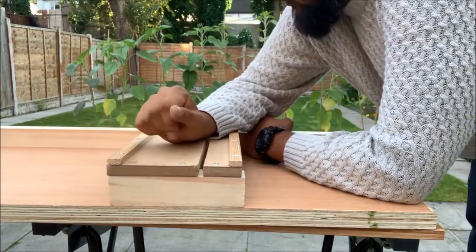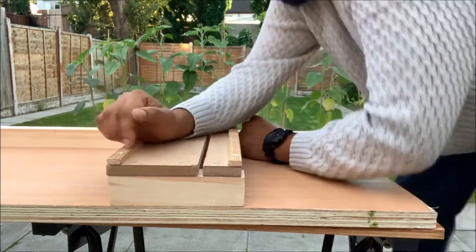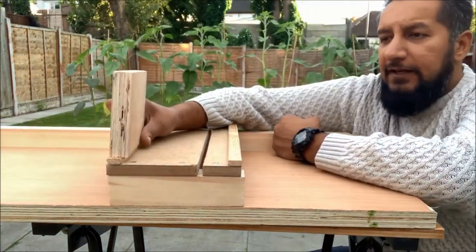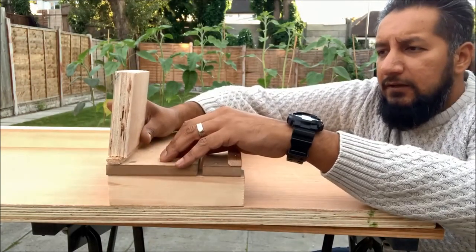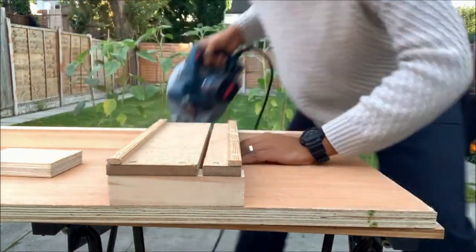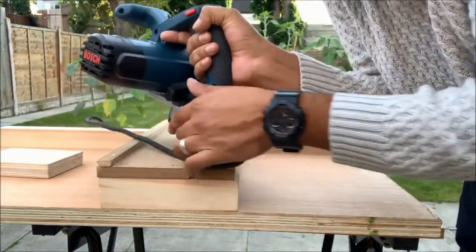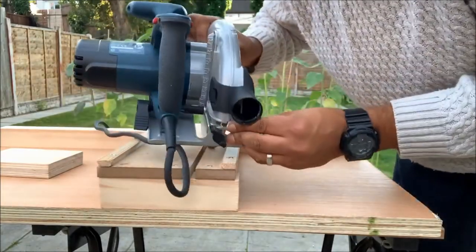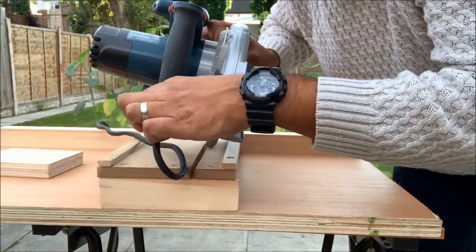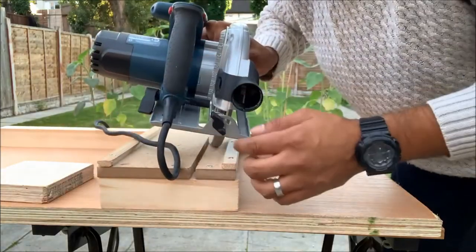As I mentioned, I did want to use the same plywood for this section, but a couple of things happened. That's the wood I would have used — cut to length, maybe an inch high — and the saw's base plate would have sat across there. But I had a little issue: my height adjustment lever sticks out slightly from the base plate. If I used inch-thick plywood, it would have caught on that lever regardless of height, so I had to redesign it and use different height wood.